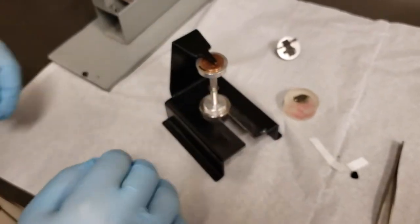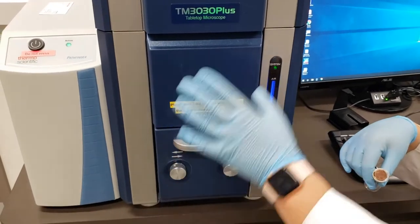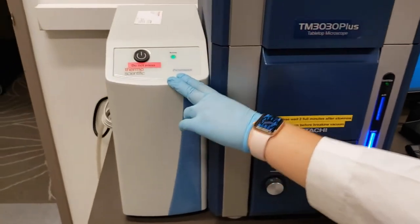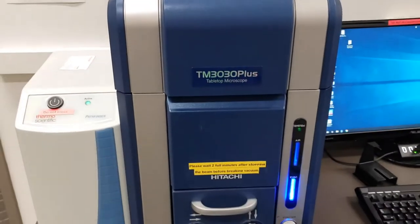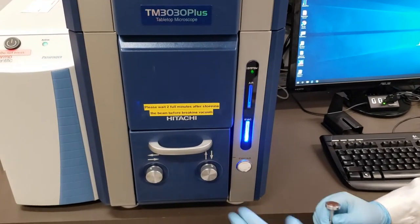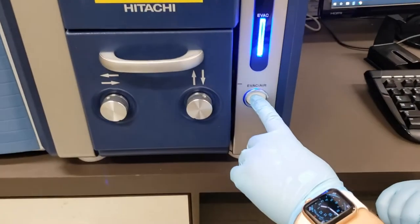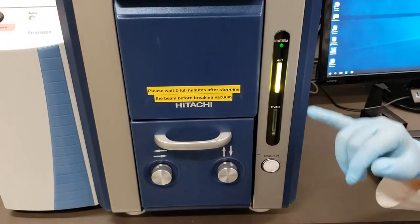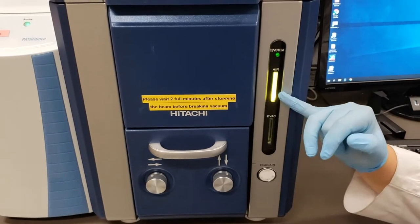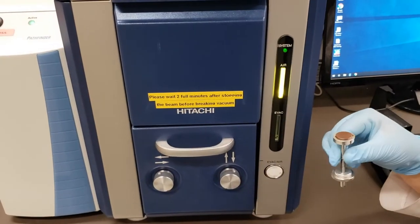Once we're done with this piece, we're ready to go over to the SEM. Here's our SEM — the little gray piece to the left and on top are our EDS detectors and electronics. This whole big blue box is the SEM itself. Right now it is under vacuum — you can tell by the solid blue light under EVAC. Press the EVAC air toggle button, it'll go flashing to air, meaning it's working on introducing air into the chamber. That will take a couple of minutes. Once this is solid, we can pull the handle to open it and put our sample in.